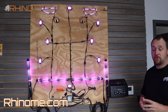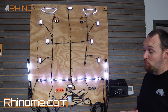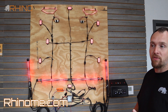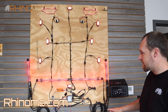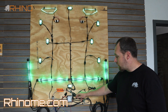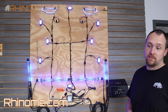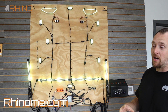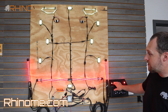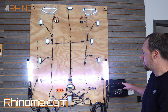There are five output channels on this board. We have a pass-through channel that does not get affected by turn signal, brake, or reverse, but it does get affected by the custom patterns on the board. Then we have left and right blink channels, which are normally tied to your front halos — those only get affected by blinking. If you hit brakes or reverse, it does not affect those channels at all.